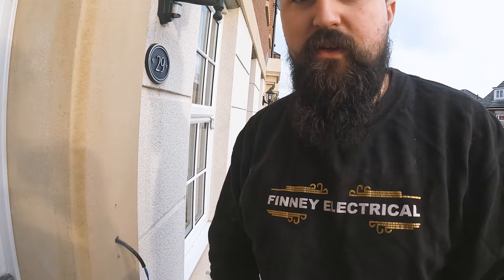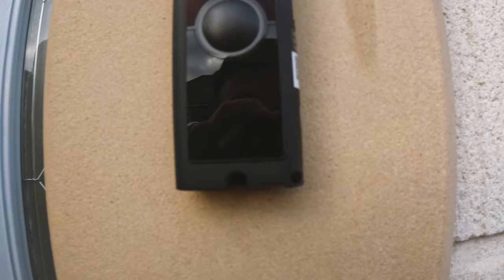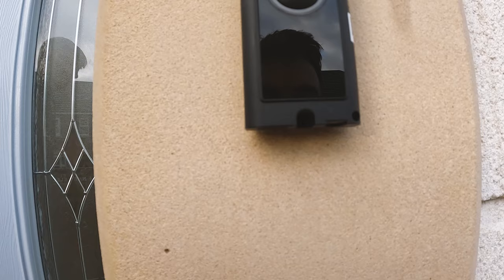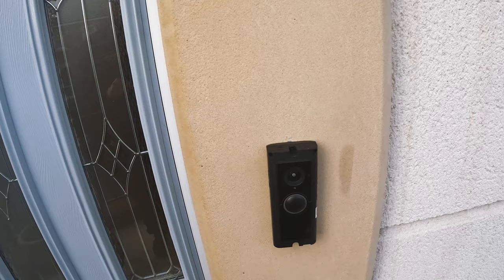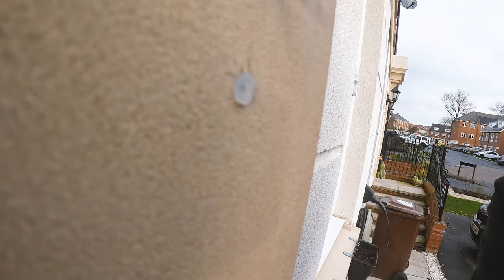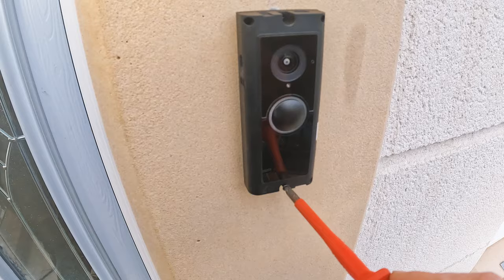So it's in the 55 hole. Use the plugs that come with it - you have to use the plugs and screws that come with it just because it's that precise. The screws need to be a smaller screw because you can't use like an inch and a half eight. So we've got one fixing in. I'm going to get the level out and mark where it needs to be. If you don't do that, you might be slightly off by a few mil and it'll literally look wonky. We'll mark the bottom out and get that fixed. So I've banged it in - it can't protrude at all with these, so you've got to get a hammer and these actually hammer flat. Get the edge of your hammer in there like that.